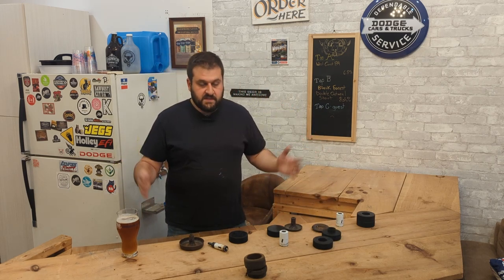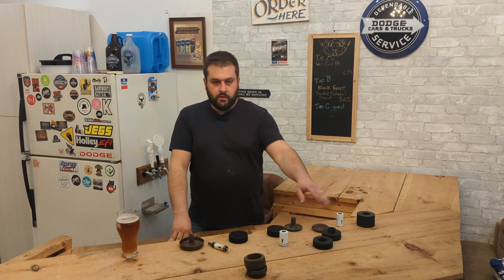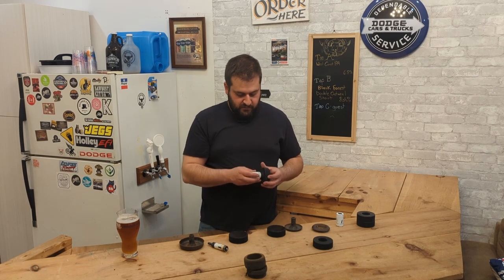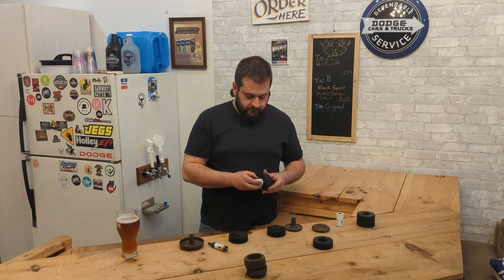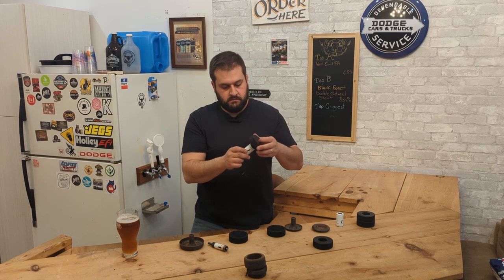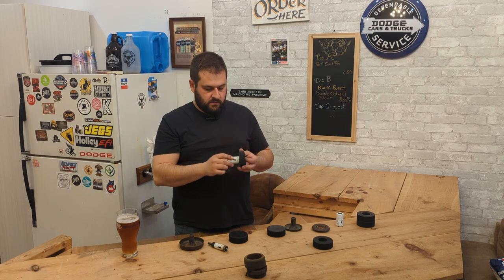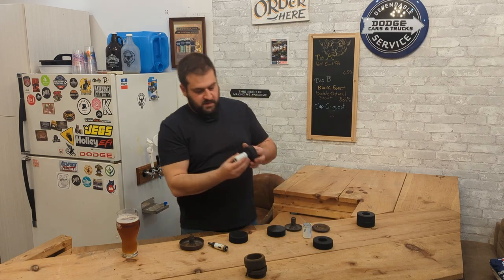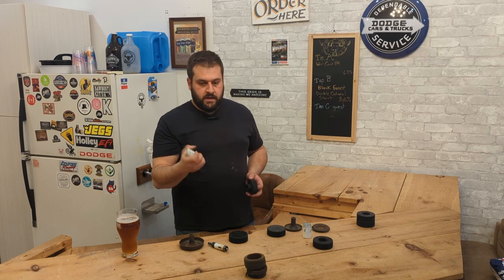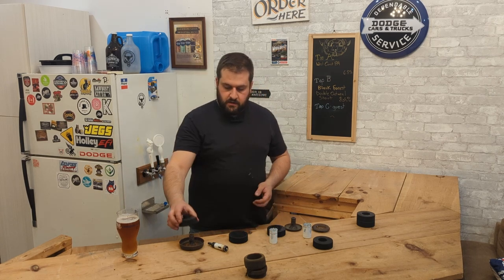And since I had to re-weld all new perches on all four corners, I could go with whatever diameter I want. So basically, it just has to be big enough for this. Basically, this is like a locating pin. So drill this, should be an inch and 3/8 hole. Wait, no, hang on. You want it to be about the same diameter so it fits snug. So you want to drill the 1 1/4 inch hole in the new mounts that I've made on the frame rail of the truck.